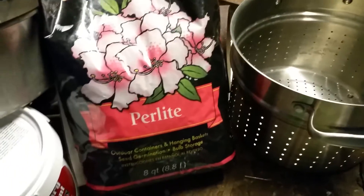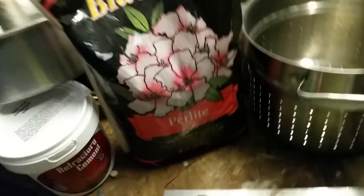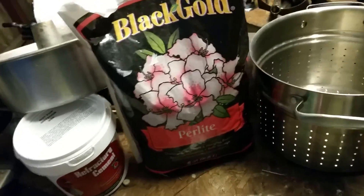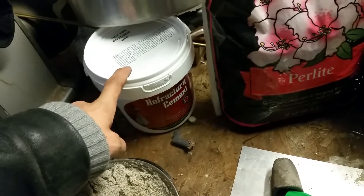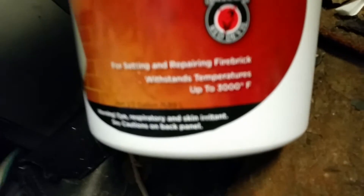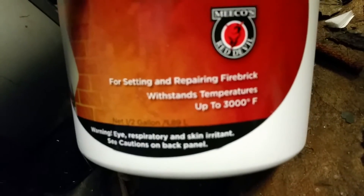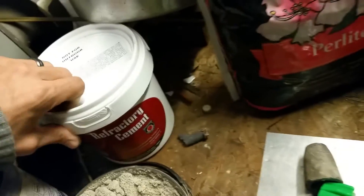This right here is black gold perlite. I got it at Ace Hardware — you can find it in just about any gardening section. What I'm going to do is mix two gallons of this — eight quarts — with a half gallon of the refractory cement. That should give me a nice 3000-degree refractory. This is rated for temperatures up to 3000 degrees for setting and repairing fire brick. I should have no problem with the stuff we're melting, and this foundry should actually even be able to melt steel.